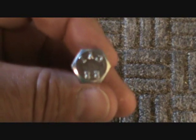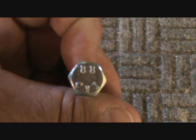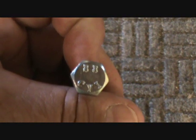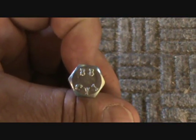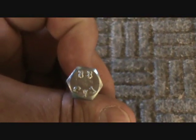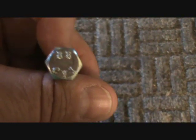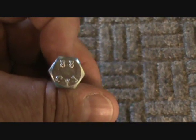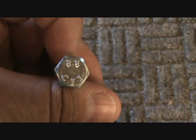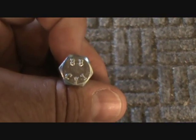Can you see that's 8.8? Anything else on there is just markings that the manufacturer puts on — you can ignore all that. The numbers are what's important. The first number is going to be the tensile strength of the bolt. The first digit represents the tensile strength over 100. So when it's 8, that means it's going to be 800 newtons per millimeter squared tensile strength. The tensile strength is the point at which the bolt will actually pull in half — that's the strength at which it actually breaks.